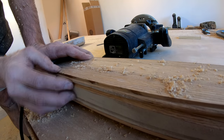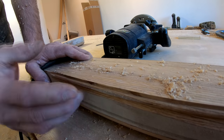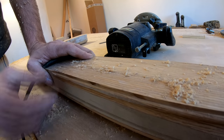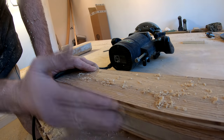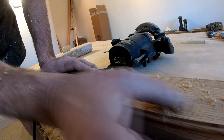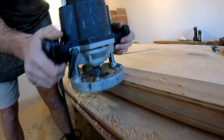It's really important I don't take it all out in one hit because that would spelch the oak and give a rougher finish. Take your time — pass it once or twice first, then go in and do the whole final pass.